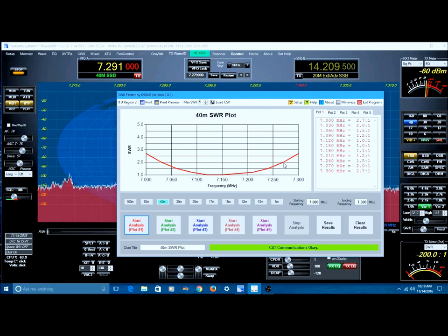Now, as I've said before, radios start cutting back at probably 1.5 to 1 — some of them start cutting back the wattage trying to protect themselves. Certainly they all cut back at 2 to 1 SWR. They could be transmitting 20 or 30% fewer watts at that SWR, rather than at 1.2 to 1 or something like that.